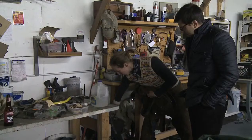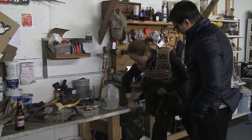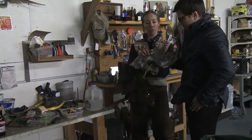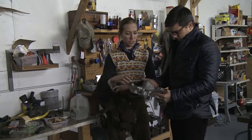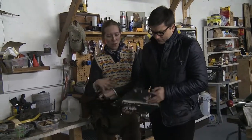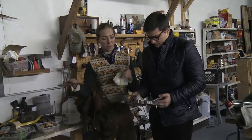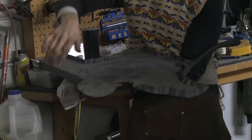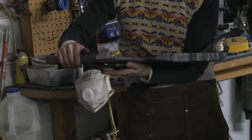This is the risk we take: sometimes molds split open entirely. These little New Jerseys are adorable but the whole thing popped open and the metal just went everywhere. Texas is a 30-pound casting, and this is what happens when the metal isn't hot enough — we're missing a whole right side. After all this work, it would be terrible to open it up and find that.